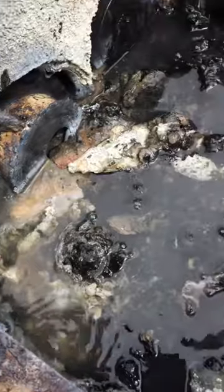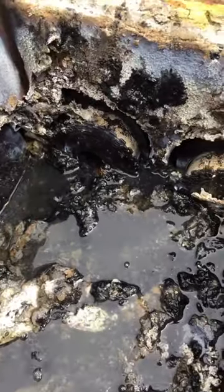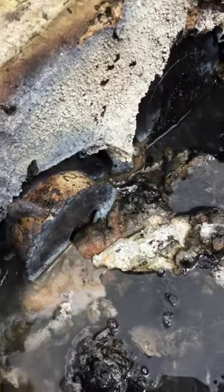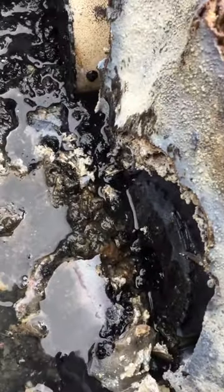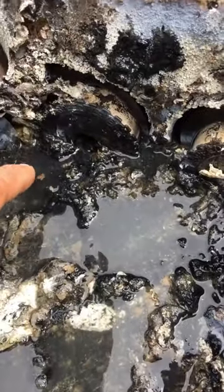Short-circuiting basically means that the water is skipping ahead, creating a channel and going out in one direction only. As you can see, that particular channel of the trench is plugged. These other ones are totally plugged as well — there is absolutely zero effluent getting to those sections of the laterals. Only this one is getting hit.